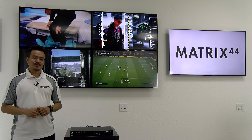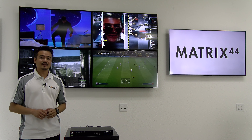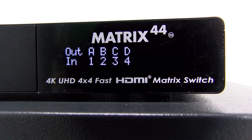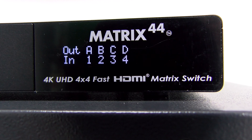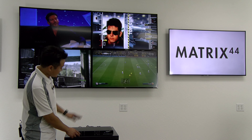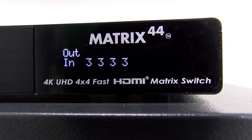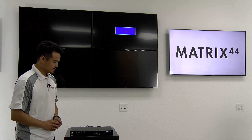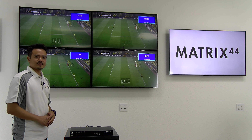One of the main features of the Matrix 44 is its fast switching capabilities. Say you're a sports bar owner and you want to have the big game on all your TVs — very simple to do with this unit. You just take your four output buttons and select them all. You'll notice on the LCD display all your outputs are blinking, which just means you're in setting mode. Now you can input a source to all of those displays. We want the big soccer game on, which is on input three. You select three, it switches all the inputs to three. Simply hit go to enter your selection, and just like that — very quick — all your displays are now showing the game for all your patrons.